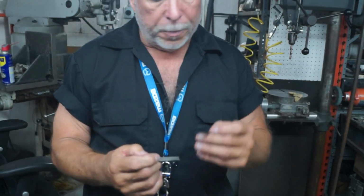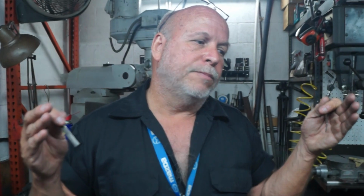The engine just retains so much heat versus the other ones, by having the exhaust port go through the engine block. But you can see that this apex seal is so much bigger than this apex seal. It's just bound to last longer. So you can take an RX8 engine and make improvements to it so that it lasts longer and takes more abuse. It's not going to take more temperature because that's the O-ring, the water seal, and it's not going to make any more power. For whatever life it gives you, you're just going to have it be more resistant against wear and tear.